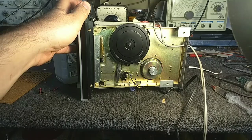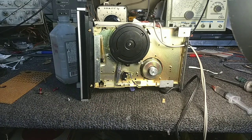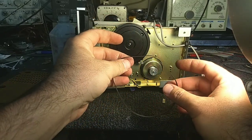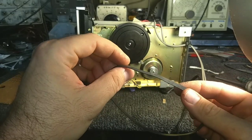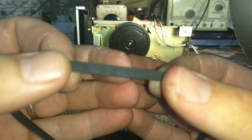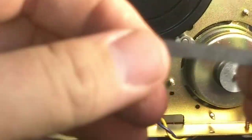We can see that that flywheel spins very well. So that's good. Another thing you can do while you've got this apart. I thought about reusing this belt, but as you can see, it's got a big hump in it from sitting for so long, and that's going to create wow and flutter problems. Also, a good way to check a belt, if you get up close to it, assuming the camera will focus, I may have to zoom a bit and refocus,